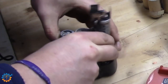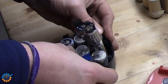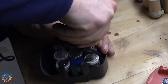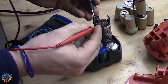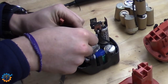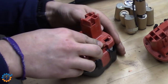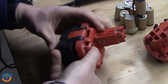If you want to see more about soldering 18650 cells or other cells, I have videos in my video list for that. The battery pack goes back into the case and it's a very very tight fit. When you press it down, just make sure you press it evenly on all the cells, because you will easily break the spot welds or the solder joints — and you can even damage the battery itself. A quick cross check confirms we still have the proper voltage on the battery pack. Reconnecting the locking mechanism for the pack to the drill, and then attaching the top part — just be very careful so you get the contacts out of the top. Mine clicked together just fine.